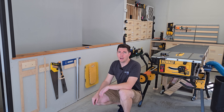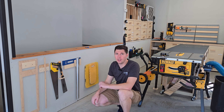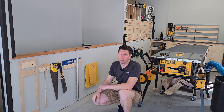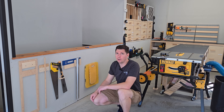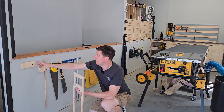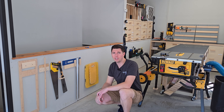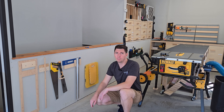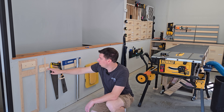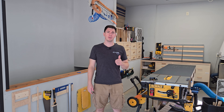This is a wall in my workshop — it's a half wall because I have a stairway on the back side. If you can imagine building an entire wall of French cleats here, I'd have a lot of unused, expensive French cleat real estate. So instead, I've built individual tool holders to hold all of my items and screwed them into the wall. These are custom designed to each tool. You'd still have to do that same process if you had French cleats, but it would require more wood to build those specific tool holders — you need a French cleat on the back and a support mechanism. These are simply screwed into the wall, hold very securely, and are much cheaper than a full French cleat panel.